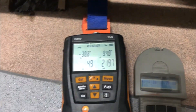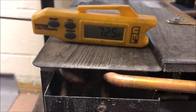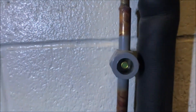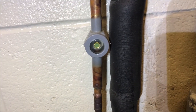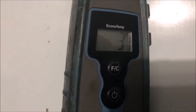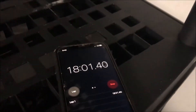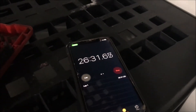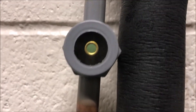Let's start charging up our unit until our sight glass is clear. We have about 72–73°F ambient. Sight glass is full — we're at 9 degrees now. Let's do a quick stress test: we're at 3 degrees — so we dropped 6 degrees in about 18 minutes. We do not have an insulated floor and this thing has been off for a couple hours, so it's really going to take its time. Now we're at 1 degree at 26 minutes — I'm good with that. That concludes our stress test.